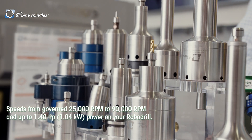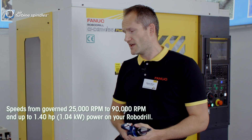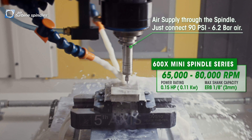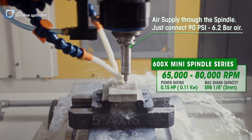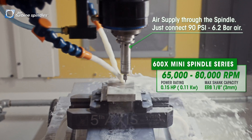It's really capable because we have a limited RPM on our spindle which has just 24k, and if we use smaller tool diameters to achieve the proper cutting feed we need more RPM, and therefore it's really helpful especially for small tools in the mold making industry.